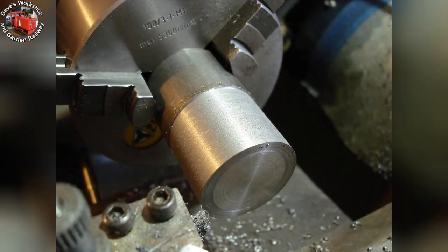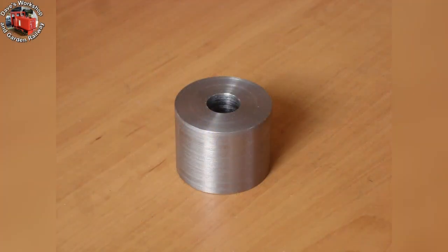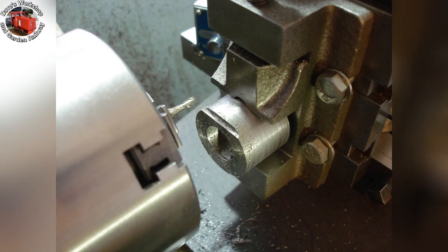Making a start on the chimney base: 1.5 inches or 38.1mm free cutting steel bar. Drilling through half an inch or 12.7mm — it's my largest drill. Parted off to length, ready for boring. Bored to three-quarters inch or just over 19mm — that's the internal diameter of the chimney. Radiusing the base to suit the smokebox curve using a 4mm round nose eBay cutter, using my favorite step-by-step method.